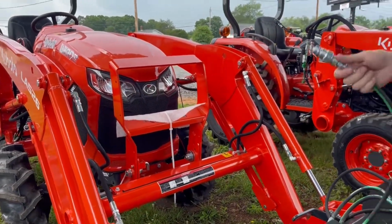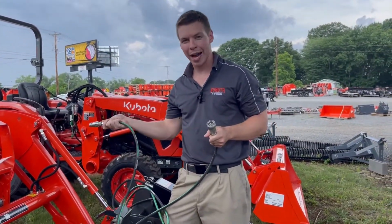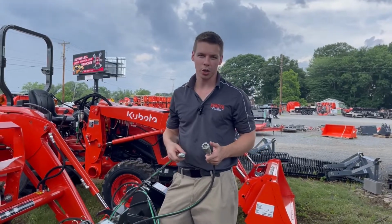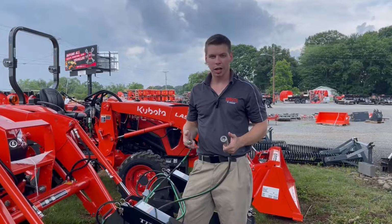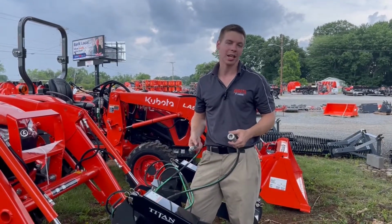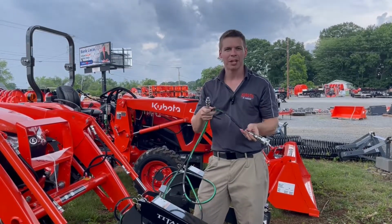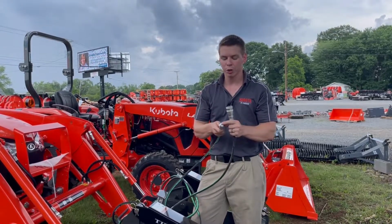Now, this one doesn't have a third function on it. There's just display on it. But a lot of times there's pressure buildup, whether it's on the tractor end or on the implement grapple or auger end. Pressure builds up for multiple reasons. You basically just unhooked, and let's say it's 40 degrees outside, and you hook up to it, you use it, you detach it. 3 months later, it's now 90 degrees outside like it is today, which is why I'm sweating, and you want to hook up. All that heat has built up the hydraulic pressure. It's now hot. These hoses are very hot. It's ugly.